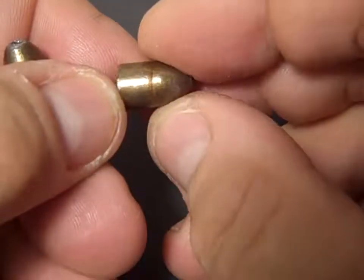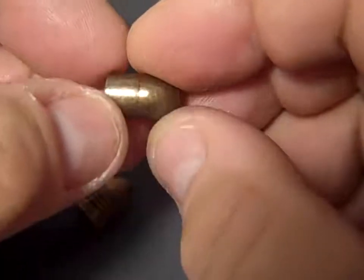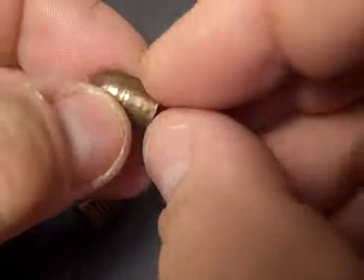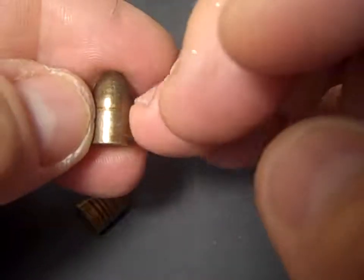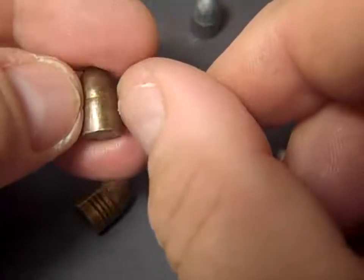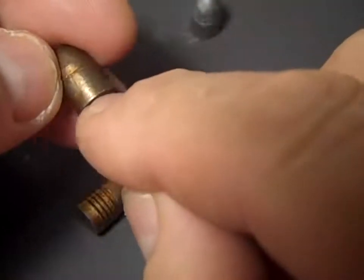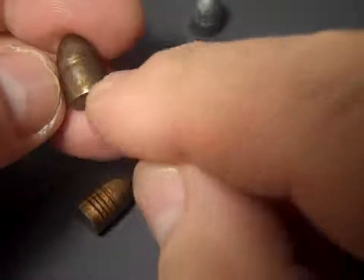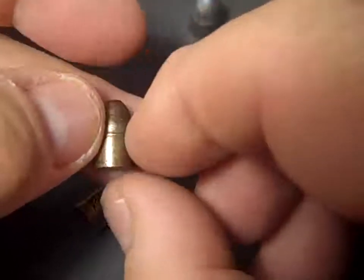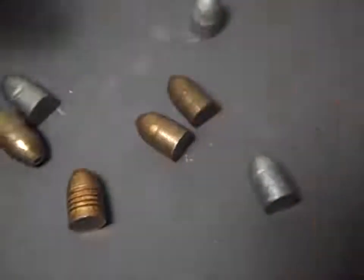It's perfectly round — it's a perfect cylinder. There's not a third of a thousandth of variation on that diameter. There is a third of a thousandth of variation lengthwise — it's just a little bigger right at the end. It's .3573 right there and .357 up there. But when you load them, the case smooshes into it a little bit. I just wanted to show you that. Thanks for watching.